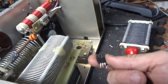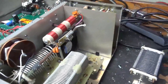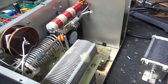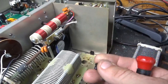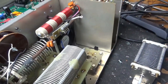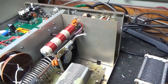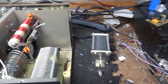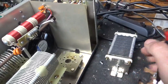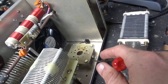The high voltage took out the bias circuit — dynamic bias — replaced that device and a couple of transistors. It also damaged the mica cap since it was on 20 meters; damaged the 20-meter mica cap for the pi input — high voltage went through it, so I changed that. The wafer looks okay, the contact on it looks good, so I cleaned it. New air variable capacitor on the plate side — I showed that before.